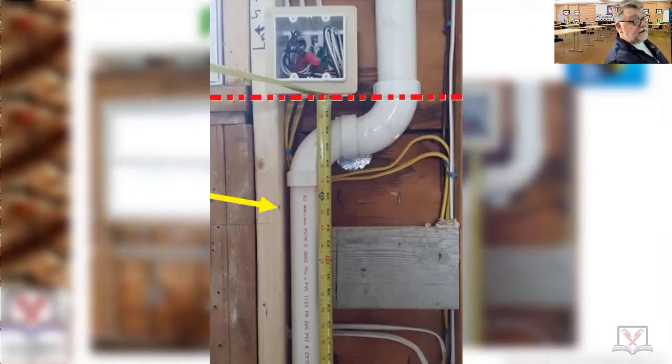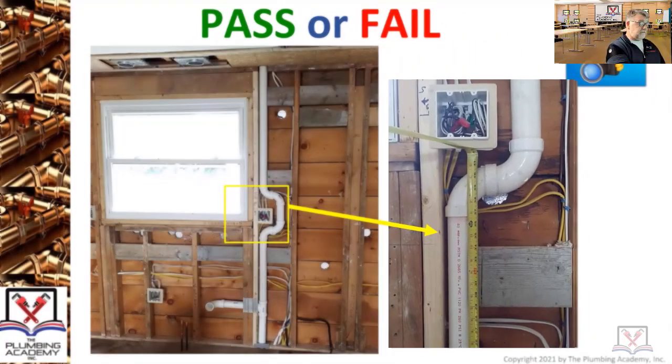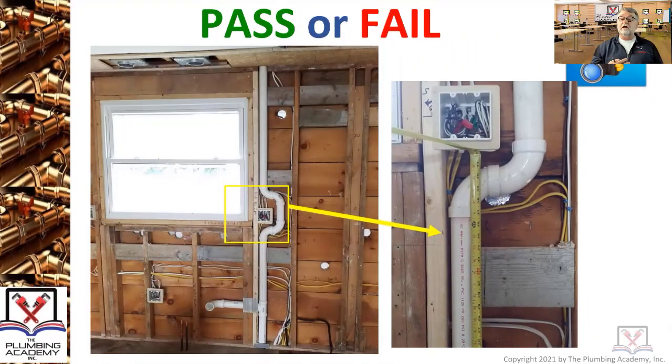42 inches — you're seeing it there. The countertop height was at 36 inches. You've got to pay attention to what's on the finished floor. All we're trying to get you to do is make sure you don't violate the code, but every time you're working with this, we're getting you to think about the flood level rim of the fixture and making sure you're accounting for that on the rough-in. Most inspectors picture what's going there — they know where the flood level rim is going to be.